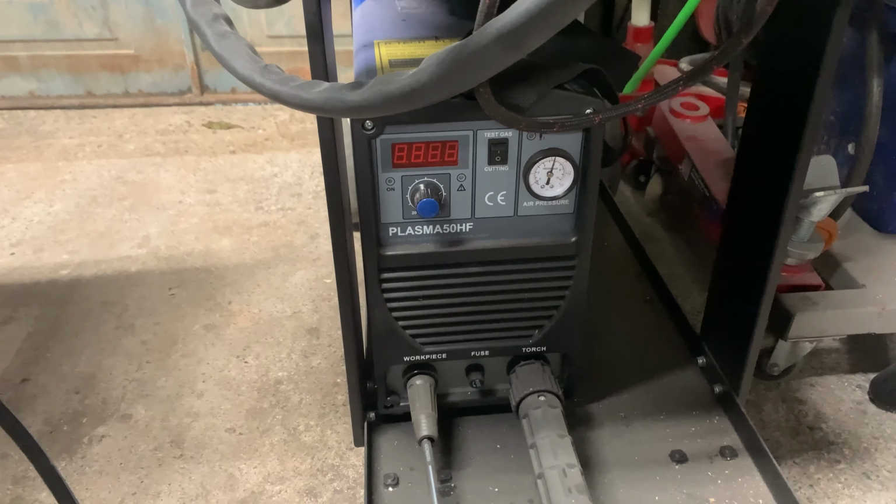Right, deburr the holes now. I got one of these from Axminster Tools, a deburring tool with multiple sizes. I don't know what the minimum size is. If I can find what I used to use, I'll show you. Something like this. There we go. It used to work okay, but this is really, really good, and really, really expensive for what it is, but it does the trick. So I'm just going to blip all the holes, deburr them, then we'll get on with the hole saw. Gives a lovely finish. Don't know if you can see that on camera, but yeah, we'll crack on.